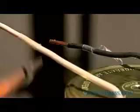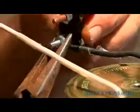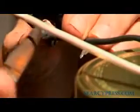This entire fuel cell runs on a 12-volt circuit, but it does run some high amperage, from 12 to 20 amps of power. You want to make sure that the wires that you use are actually oversized. That way there's no heating of the wire and you have an extremely efficient electrical design. You hook this onto the circuit breaker, and this is going to protect you against an electrical short. Also, if you add too much baking soda to your fuel cell, this little circuit breaker will actually cycle on and off and protect you from pulling too much electrical energy from your alternator, your car's electrical system, and protect the wires from actually burning up.